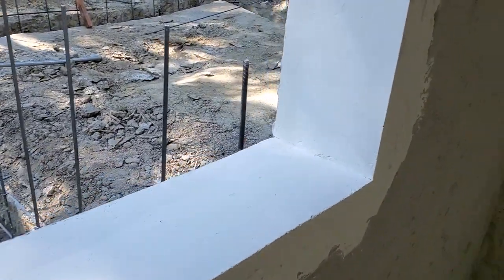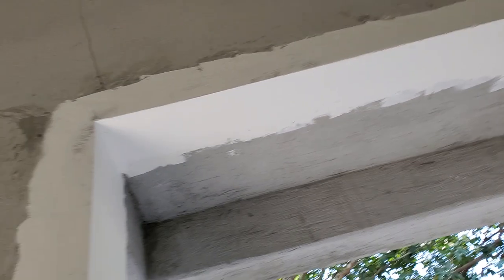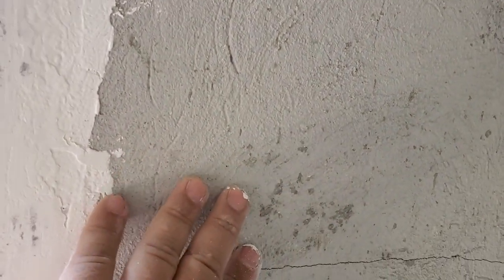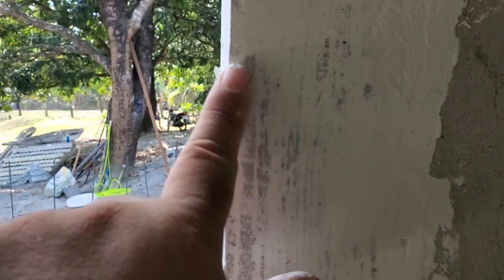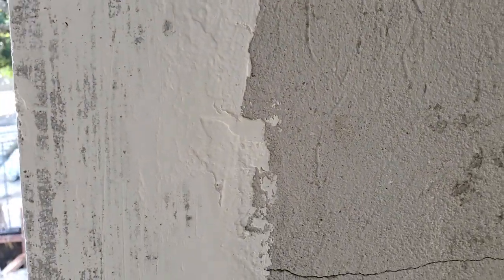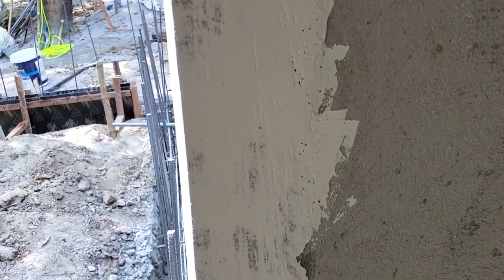So here's what we've done. I've done a lot of this myself too. Since we're getting the windows put in, I didn't want them to screw right into pure cement, so I decided to skim coat it and put a coat of so-called primer. Ideally you should smooth this out as much as possible with a steel trowel. If you do too thick of a coat, you've got to sand it down. If you do like four millimeters, that's not good. The most you want to do is probably two coats and a maximum of a couple of millimeters.